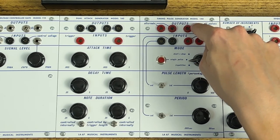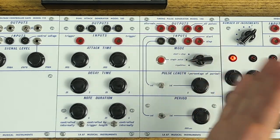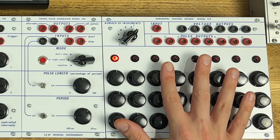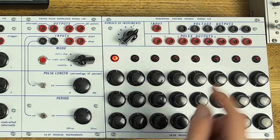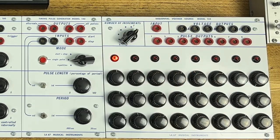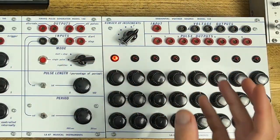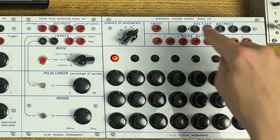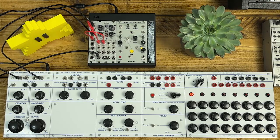There are two pairs of outputs: the 'all pulses' output fires every pulse of the clock, and the 'alternate' outputs take turns outputting the clock. The 123 sequencer has three rows of eight values, and you can control the number of steps from two to eight. There are pulse outputs for each step, plus three pairs of CV outputs. Not a huge amount of controls, but there's quite a lot you can do with creative patching. I really like the limitations it gives me to force me to think outside the box.